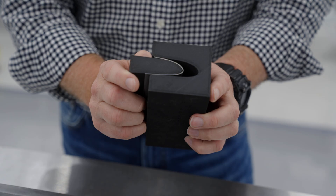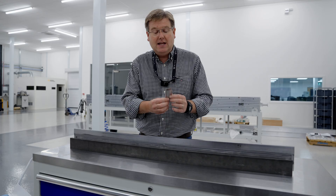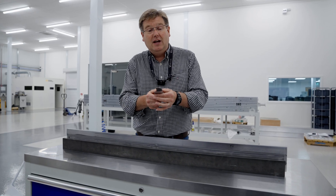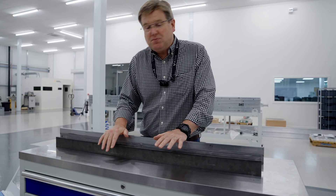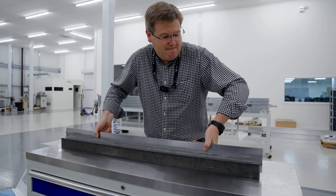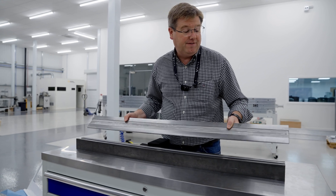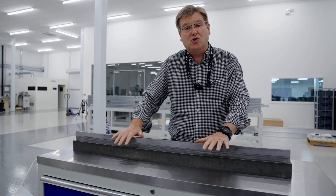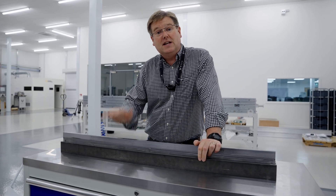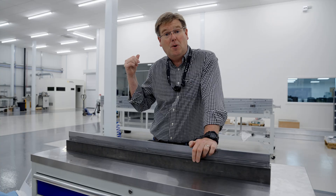We press sheet stainless steel in between a form tool to produce the erosion shield section out of simple sheet metal. What we've done here is we've just produced one of the male and female parts of the metal press tool to form the first portions of those erosion shields, doing some pressing trials over the next few days, so that we've got the erosion shield ready for the first composite blades when they come out of the laminating shop.